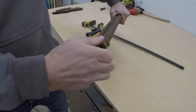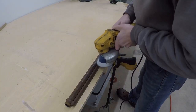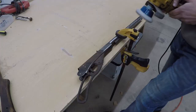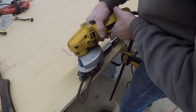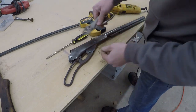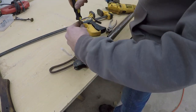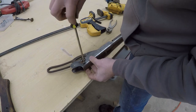I remove the inside of the barrel by simply twisting it counterclockwise. After years of neglect, you can see that the barrel of this gun is very rusty. I didn't want to soak it in any solutions because I wasn't going to take out the center components, so I used a brass wire wheel and an angle grinder. Once I was done removing the rust with the wire wheel, I removed the trigger and the lever — one bolt and nut for the lever and one bolt for the trigger.